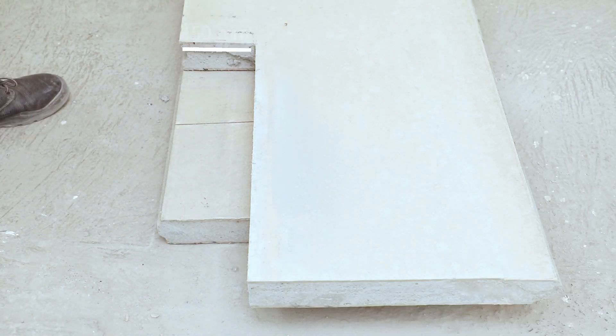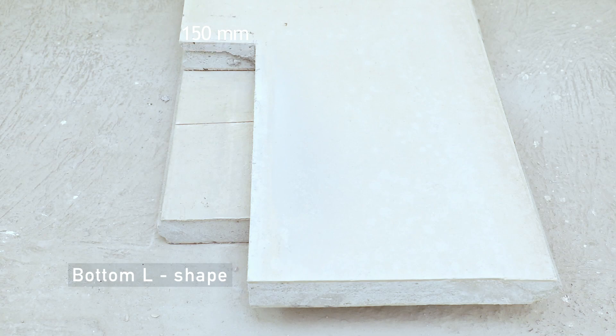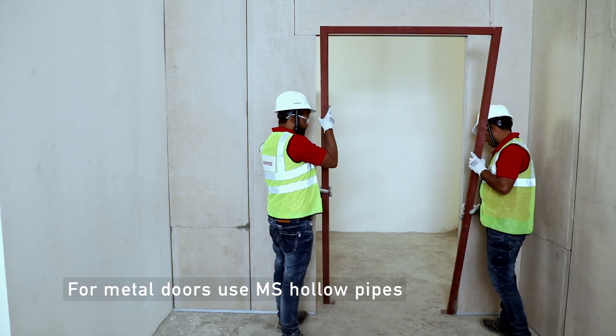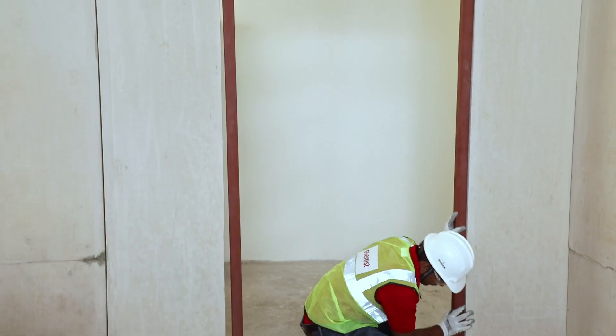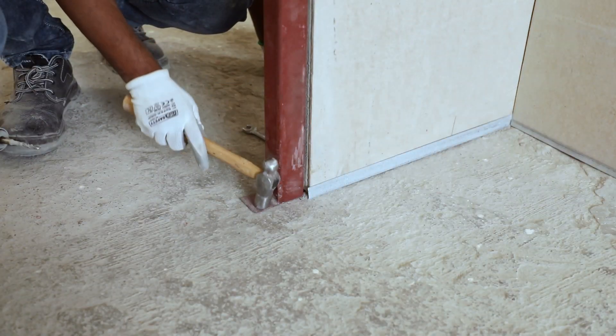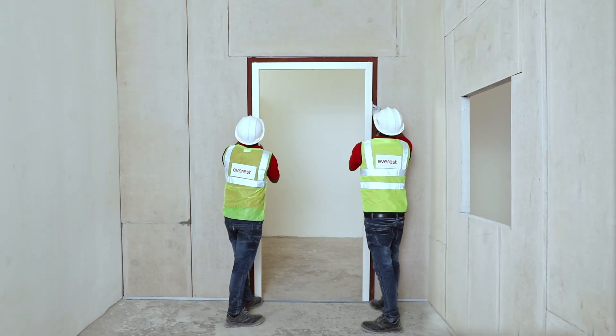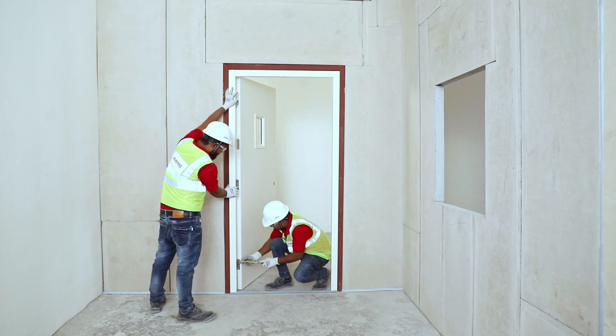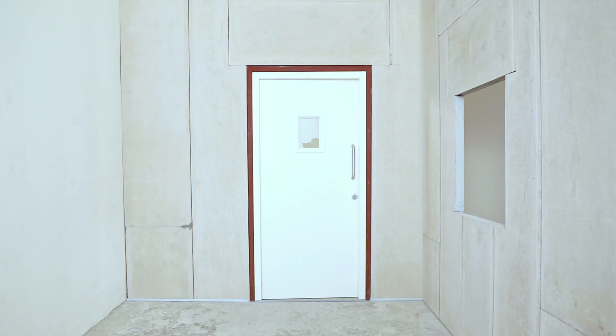The length of the lower part of the L-panel should be 150mm. In front of the door opening, install vertical wall panels in the floor and ceiling track profiles. To install the door frame, use MS hollow pipes for stronger fixing. Install MS support as per the door frame profile so that the door frame fixing becomes easy and it will not wobble. Now the partition wall with door is ready.